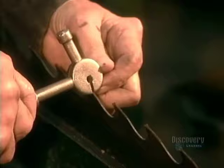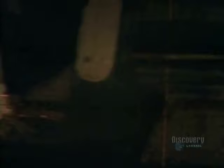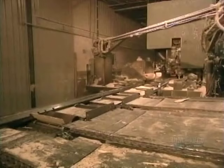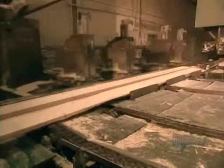In this sawmill, there are two production lines. The wider logs go through this saw. The worker at the controls uses a laser to help him position and reposition each log as he runs it through the saw several times to cut it into as many 4 by 10 inch pieces as possible. An average log usually yields about 7 or 8 pieces.